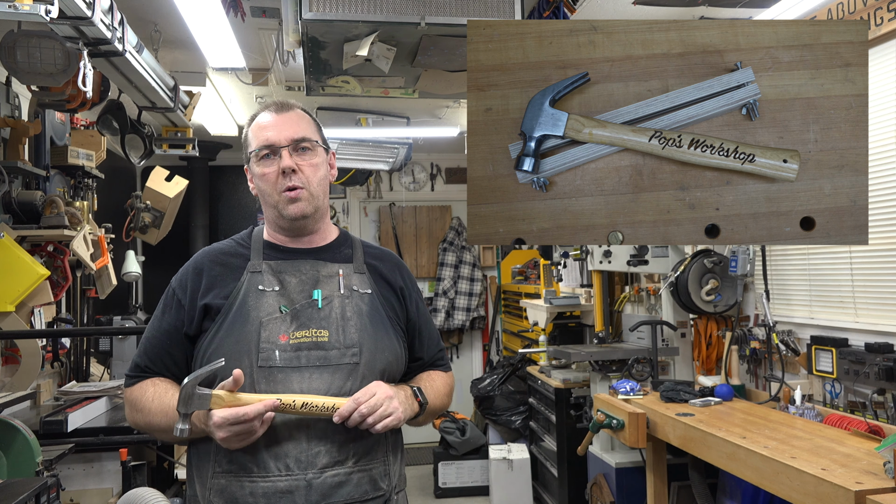The other thing I want to point out, guys, about going slow is the harder the wood you cut on a scroll saw and the thicker it is, your blade has a tendency to deflect. And what I mean by deflect is that it bows. It will bow out. It will give you a curved wall cut. And by doing that on such a smaller piece with such intricate things as scrolled lettering, what's going to happen is it's going to blow out at the back. It's going to cut at all the pieces. It will not look good.